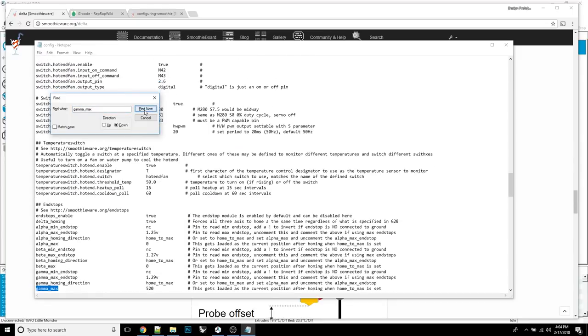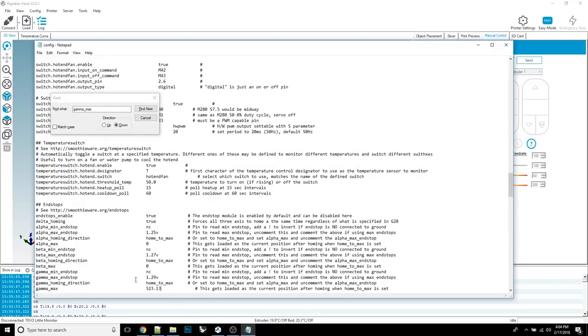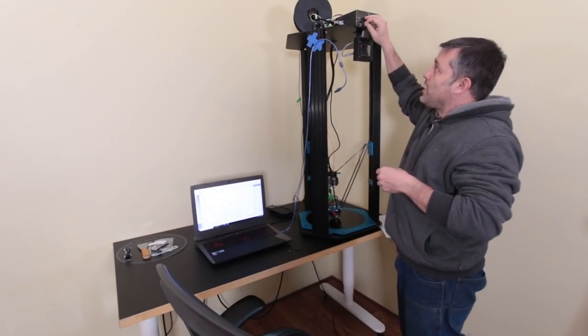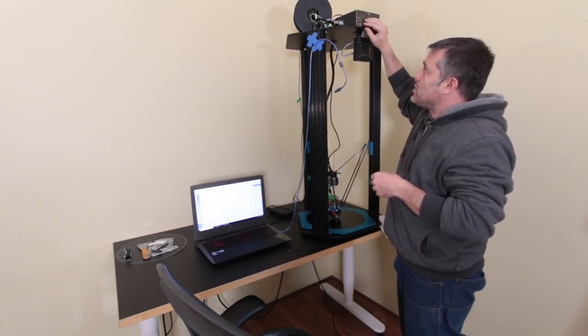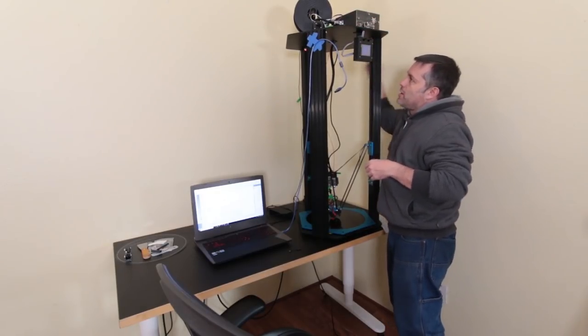Find next, we want just gamma max, and there it is. It's currently set to 520, so we want it to be 520 plus 3.13. So this should be 523.13. Now we save this, and that's saved to the micro SD card, and we can now eject that card. So put the micro SD card back into the printer and turn the printer on and also plug